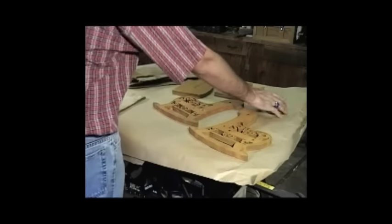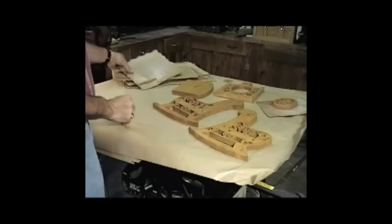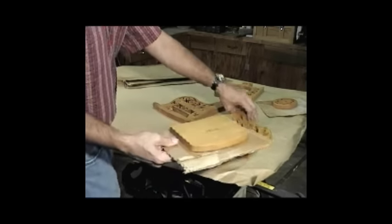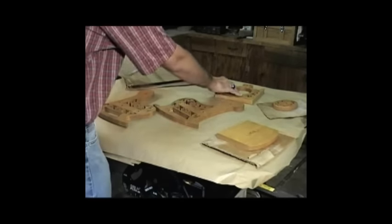Now here's a tip for when spraying fretwork. Cut out cardboard and use the cardboard to lay the piece on. The Deft won't bond the piece to the cardboard unless there's a buildup from previous use. The cardboard also allows you to hold the work and rotate it around. Once again, prior to using any solvents or chemicals, we're going to make sure we're working in a well-ventilated area.